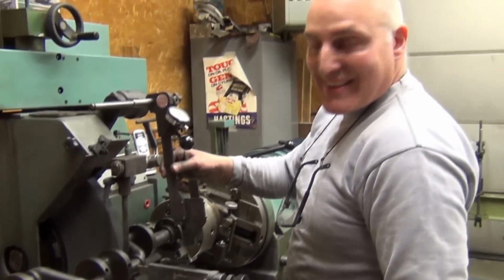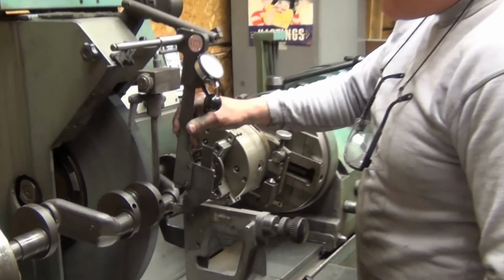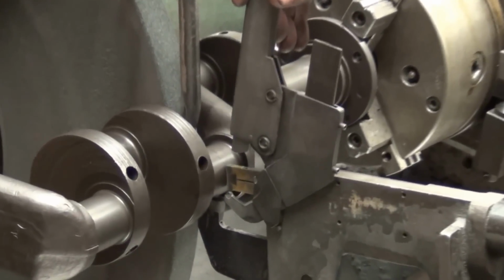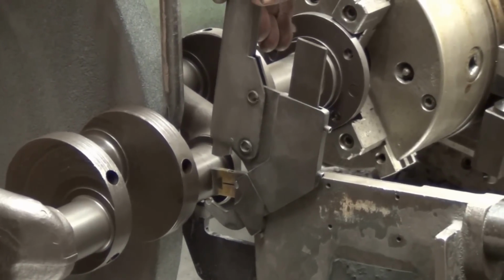This is the caliper that, as I'm grinding it, I can see how much material is getting removed as I'm grinding. In other words, it's in process. I can control the amount rather than depending on the dials, which aren't accurate at all. I can depend on this